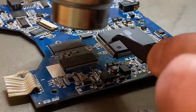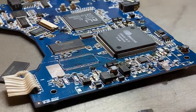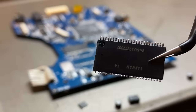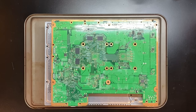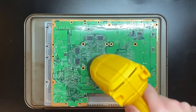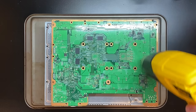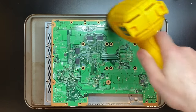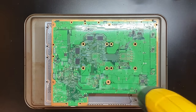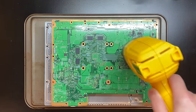As you can see, within less than a minute I can start knocking components off this test board. Now I'm going to start by warming up the back of the motherboard for about one minute, three inches away from the board, constantly moving. The constant motion at this distance isn't going to melt anything on this large of a surface area — all we're doing at this point is warming everything up.